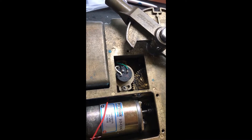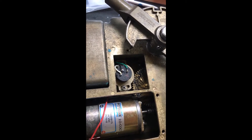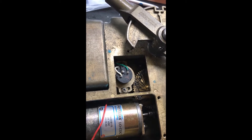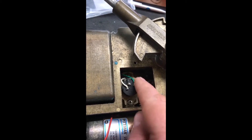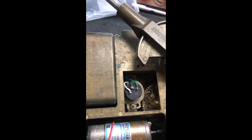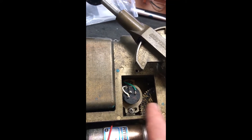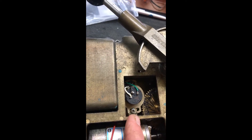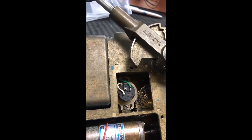We're going to desolder the wires from the back of the potentiometer. It's always worth noting where the potentiometer sits in the bracket so that when you put it back, the wires will reach back on and you can solder them in the same position again. If you've got it twisted 180 degrees, you'll have to stretch the wires to reach, so note the position carefully when fitting the new one.